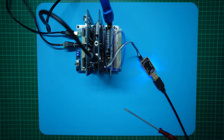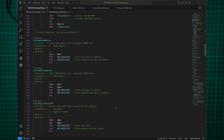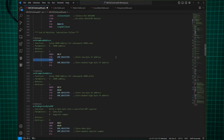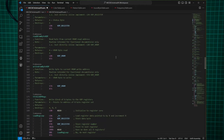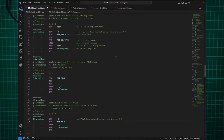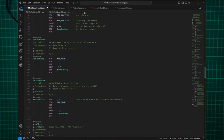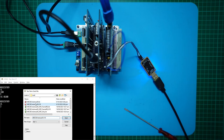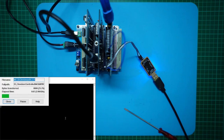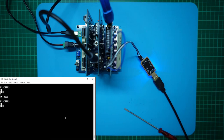Note that the sound will still play at the right tempo, because the sound is being updated by a 20 ms frame interrupt from the video chip, making it independent of the system clock speed. What we will probably notice is that the notes themselves will be double the frequency, as we are now clocking the sound chip at 4 MHz instead of the 2 MHz the Christmas demo was written for. Let's assemble that and transfer the program across again.